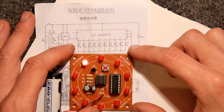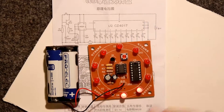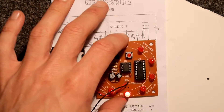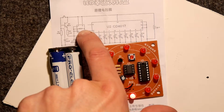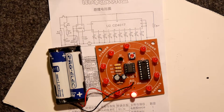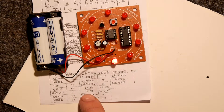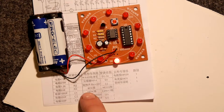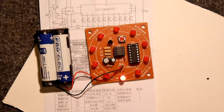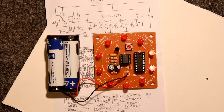We could work out exactly which way. Looking at the circuit: you're pushing positive onto the base via the switch, so I think you're charging this capacitor and then it depletes. The output goes into this chip - the decade counter. Every time it gets a pulse it moves on to the next LED; it's like a register moving through. Once the capacitor depletes, it slows down and stops on one LED. That's what you're seeing right now. It's quite a neat, simple circuit - don't quote me in your college lecture though! Please feel free to subscribe, leave comments below, and thank you for watching.